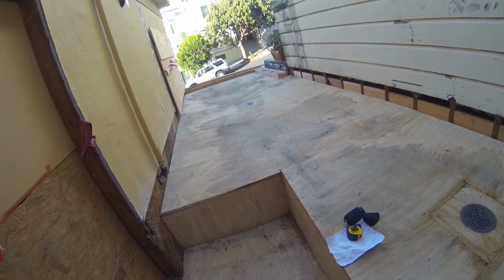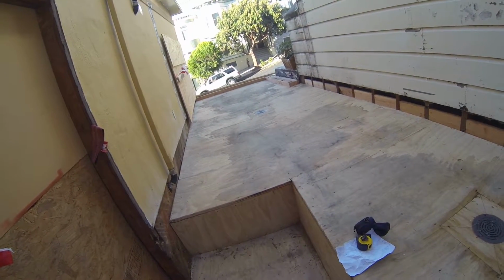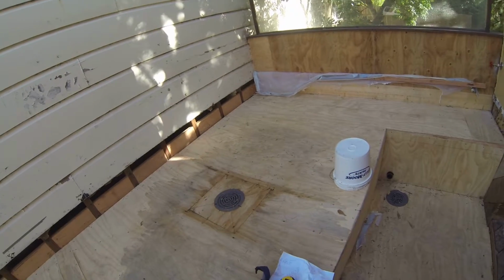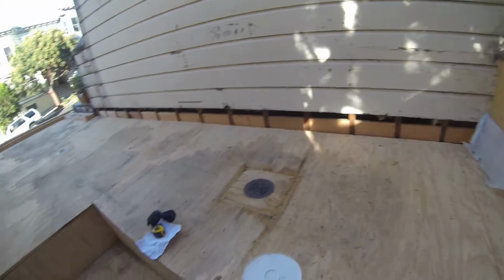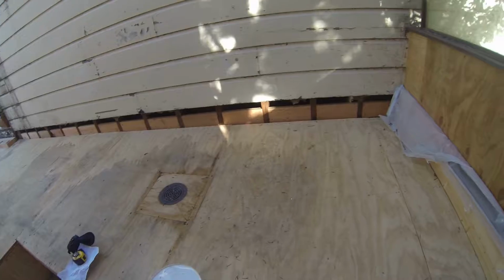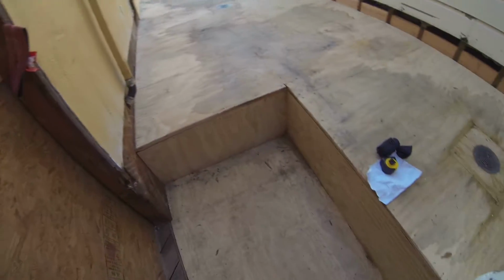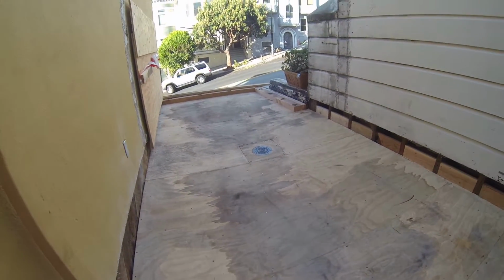So I think if you come in here, give this thing an aggressive sanding to get rid of lumps and bumps, and take the edging sander real quick, then get this thing mudded out. You should definitely be able to get the two primary pieces set the same day here. The only part is the thickness of the mud on the back corners, but even so, that doesn't need to get secured instantly. So if you can get the two primary pieces in, then you can start working on the smaller deck. But anyway, that's the quick layout over here. I hope this makes sense.